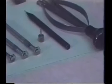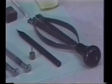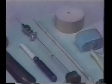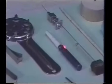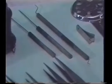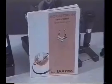a working stem, a post-bending tool, a hand remover, Rodico or a similar product, pithwood, pegwood, oil and an oiler, a case wrench, and an index wheel holder, and 3 homemade adjusting tools which will be described later. A high-intensity lamp and a copy of a 214 manual would come in handy.